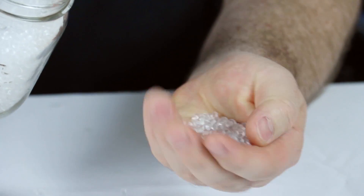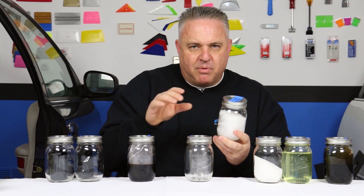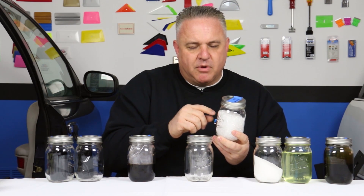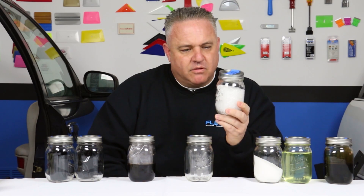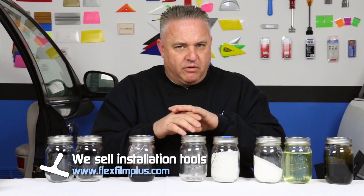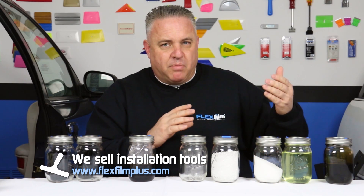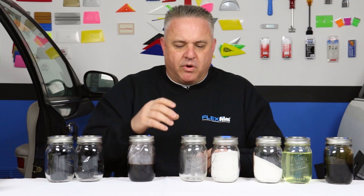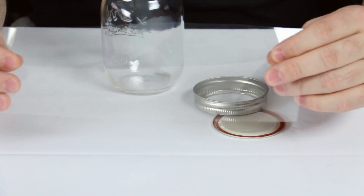In this jar I've got these little beads — they're round. Some people put dye in these beads and melt them so the polyester itself has dye in it. Some people put dye in the glue, but domestically we're going to talk about this particular method because this is what is popular for us as window tinners. After these little beads are manufactured, they are melted down in a machine called an extruder. The extruder literally pulls the material through a series of rollers, and out comes what we know as polyester, which is optically clear — the chassis or foundation of our window film, represented by this bottle with a clear piece of polyester inside.